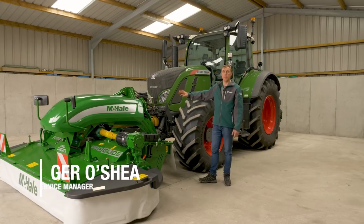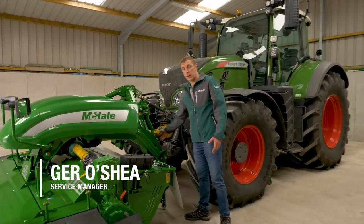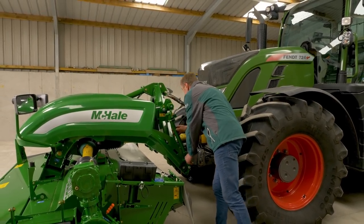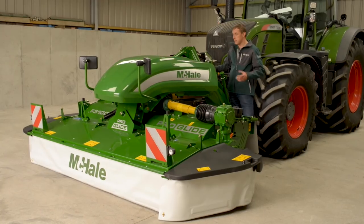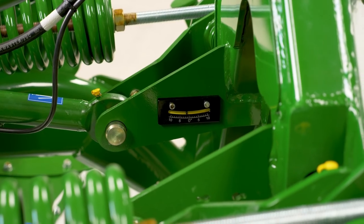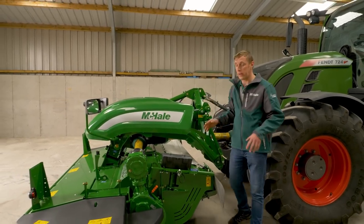Thank you Mike. Here we are hooking up the front mower to the tractor. We've connected our lower link arms, lifted the mower off the ground, and folded up our two parking stands out of the way. We've connected our top link — you can adjust your lower link arms up and down to connect the top link and set it at the correct height. We have an inclinometer here on the front of the mower giving you the bed angle, so you can adjust your top link to suit the correct bed angle.